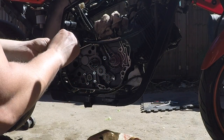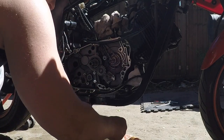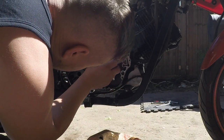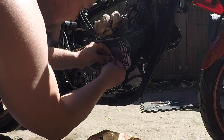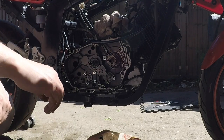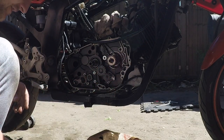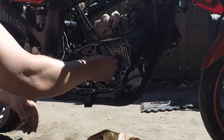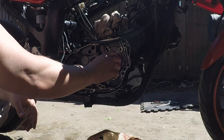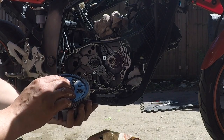The pin goes right in here. Put your cog in oil so it's nice and oily, then try to get it straight onto the pin point in here — lovely, just push it right in, brilliant. You've also got a washer which goes in here as well, right there, and a screw which goes back on — hand it down clockwise, you have to screw it back on clockwise. We're not going to fully tighten now, just put it on for now.